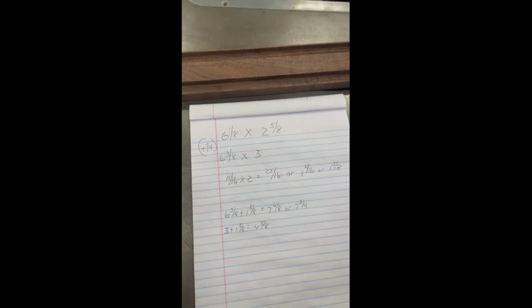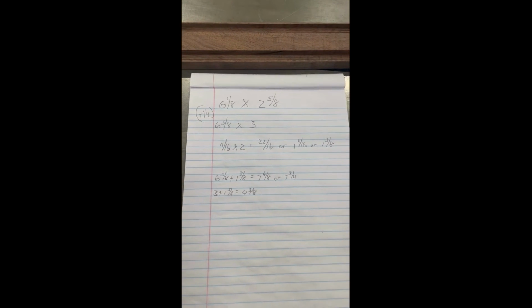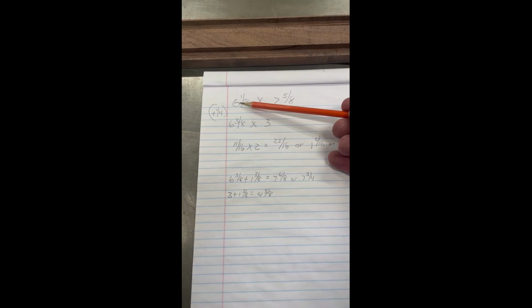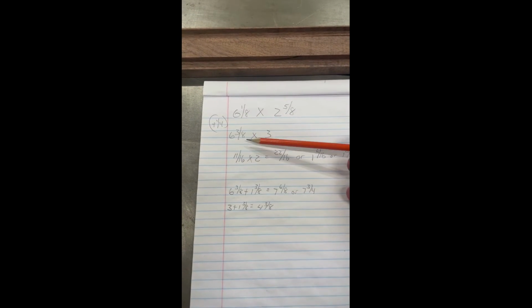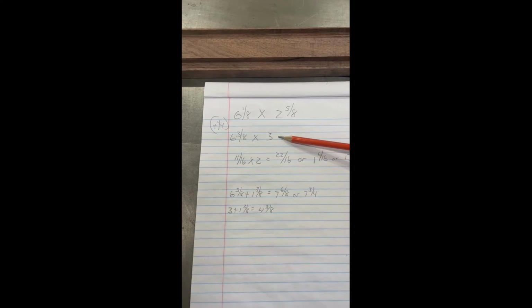Okay, guys, so now that we have our grooves cut in our piece of wood, we're ready to go ahead and lay out the sides. So we want to figure out what the length of pieces are going to be. So again, a dollar bill or any U.S. currency, modern, is 6 1/8 by 2 5/8. Now I want a little bit of wiggle room, so I'm adding a 1/4 inch. So that takes it to 6 3/8 long by 3 inches wide.